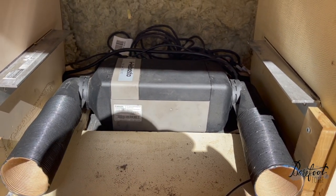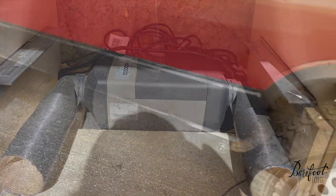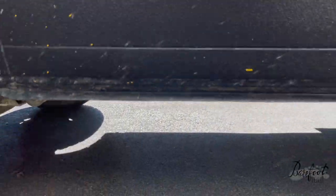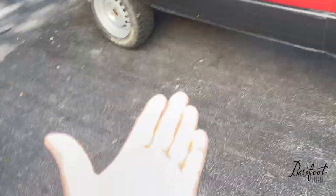We'll just let it run and warm up — I'm going to let it run for like an hour. The worst thing you can do for these heaters is run them for a short period of time. Here's the sound we hear outside the car — it's noticeable. You wouldn't want to be camped in a tent right here, but it's nice and quiet in the car. Once you start building up carbon in there and you start to have a problem, you get a less reliable combustion process, which results in more carbon. So you just need to stay on top of it and then it's fine. It was like a three-hour job — not that big a deal.